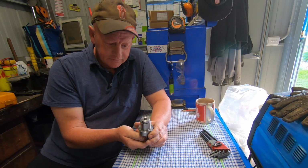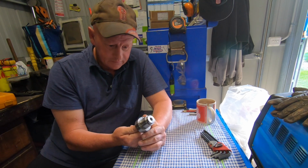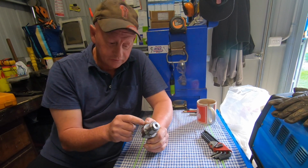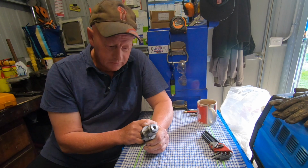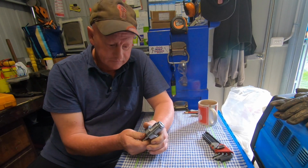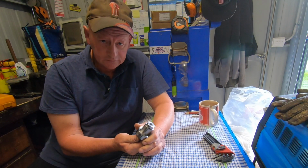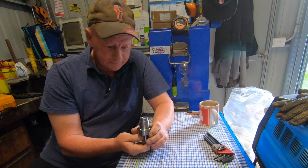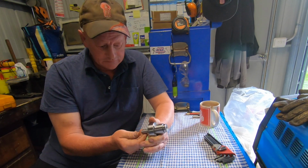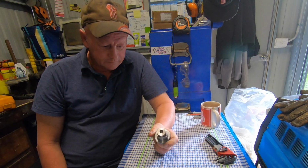It's a good project because you've got to hit some numbers pretty much smack on. I sanded the journals for the spindle. I actually sanded those down to dimension. I can't cut that precisely on that lathe, so that took a little while to sand them down, but anyway, they were there in the end. They got done, and we ended up with a pretty cool looking tool.